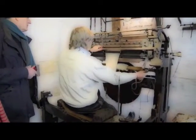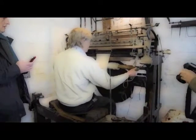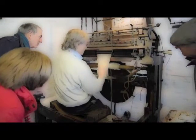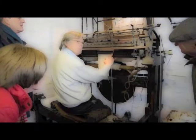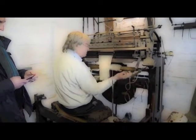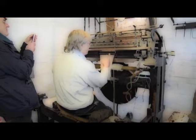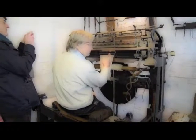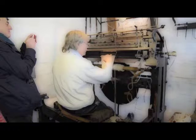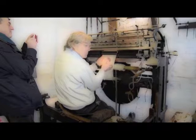So this is going to put the yarn carrier across and develop the first set of loops. You've got two needles, and a loop, two needles, and a loop. You've got quite a long loop, I'm going to add a centimetre and a bit long. The next stage is to bring the fixed sinkers down, or what's sometimes known as dividers. And what these will do is to go between these needles which don't have a loop between them. And they will start to create a new loop, and they'll do that by taking yarn from that long loop. That will reduce in size as the new loop gets bigger.